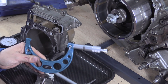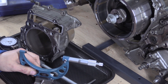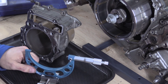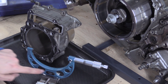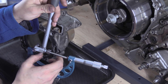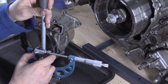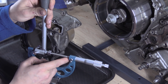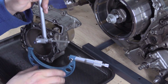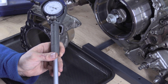I've set this and locked this off. The cylinder size is between 98mm exactly and 98.015mm — so 98mm and 15 microns. I've set this to 98.5, so 98mm and 500 microns. What you do — and I've got a little clamp here — you'd normally use your vice, but I'm trying to do this all in camera shot. You just stick the micrometer in your vice like this. Usually that's why they have a plastic bit on the bottom so you don't crush it.